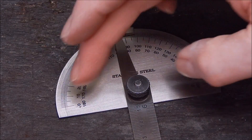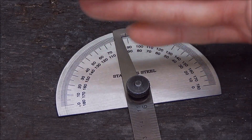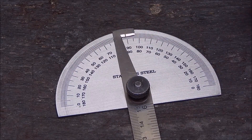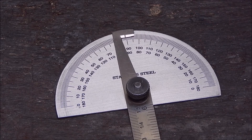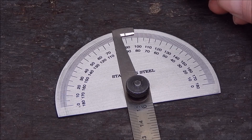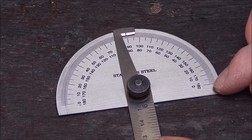When you grind, you apply most of your pressure on this side of the protractor, and that will tend to put more grinding action on that end of the base. It takes a very, very tiny bit to correct these, so don't go overboard. Just do a bit, check it, and if you're not right, just do a little bit more. The old saying: you can take metal off easily, but it's hard to put back.